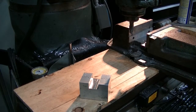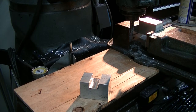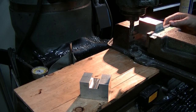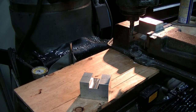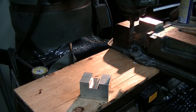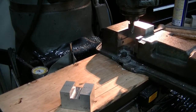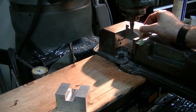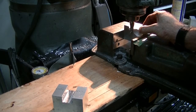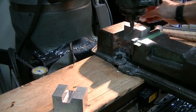What we first are going to do is set our block into place. Seat the block, make sure it's nice and tight on our parallels. We'll bring the x-axis over. What I did was I used a piece of zigzag to bring it in within just a little friction on the edge of my vise that's fixed. Then I set my zero.